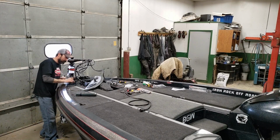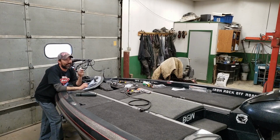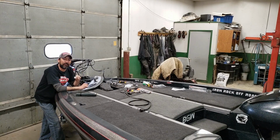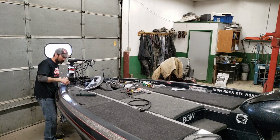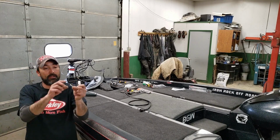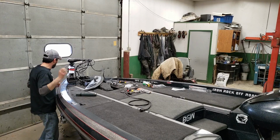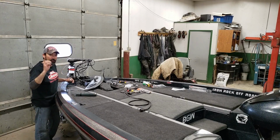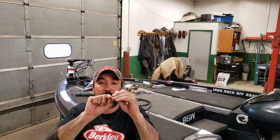But anyways, I just filled the holes, and you gotta let it sit and dry. I let it sit all day. And then I put my panel back on there, lined everything up, and drilled the holes for the size screw that I wanted. Use the right bit now. Don't use too big of a bit, or too small. You just want to get that right bit, the bit that fits that shank in the middle.